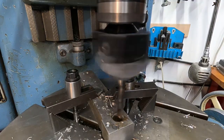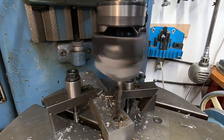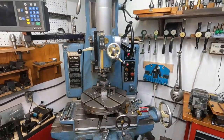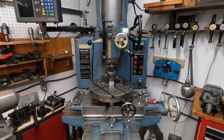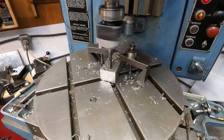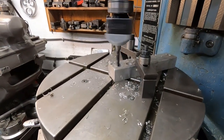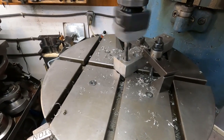That's about a three-quarter inch hole in a little piece of scrap aluminum. Stand back and look at this thing — it's about eight feet tall. Running at about a thousand RPM and three-quarters of a thousandth feed speed.